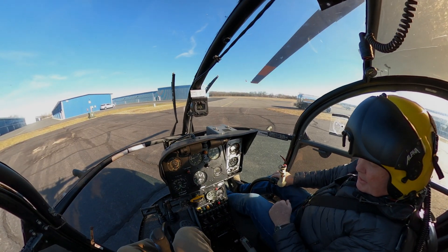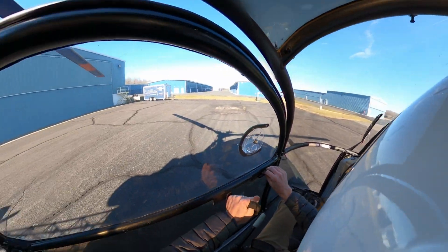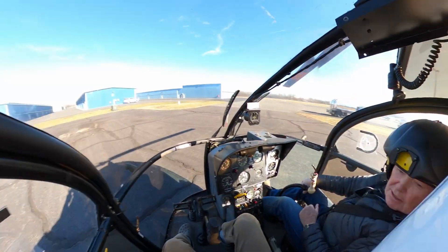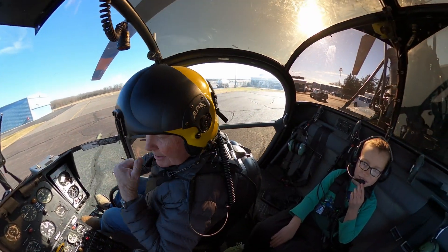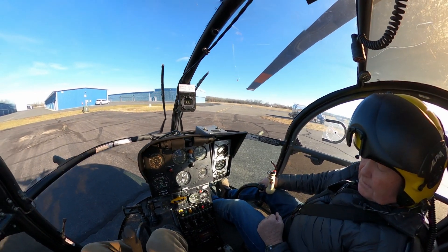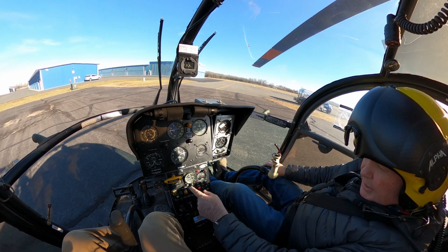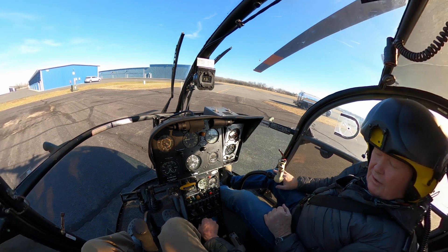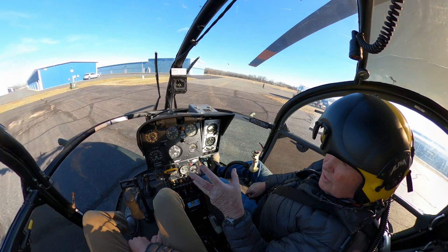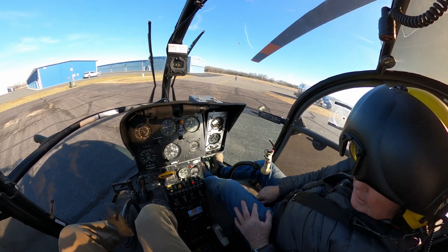Okay, get the battery. Did you hear that, Caleb? Can you hear? Yeah, okay. When we turn it on, as I put the fuel pump on, put the timer on 25 to 35 seconds to get some fuel in. It hasn't flown since November, so it probably needs a little more time on the fuel.